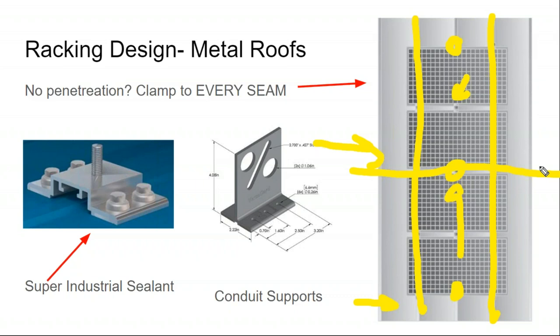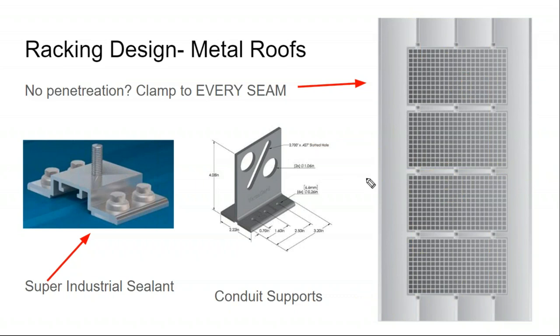The standing seam roof solar racking manufacturers will actually provide guidance to attach to every single seam going across the rooftop. However, a lot of installers are thinking spans of 4 feet being conservative, and solar rail being able to take 6 or 8 foot spans. Your metal roofing panel on a standing seam metal roof no longer has that long span that you can take advantage of. Regardless, there's racking for every kind of roofing material.